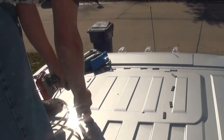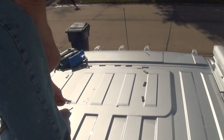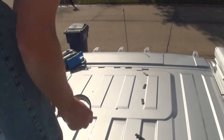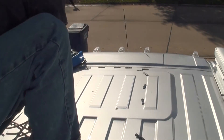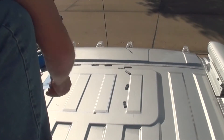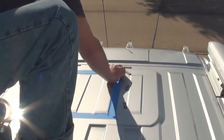The steps are easy but cutting a hole in your roof can be intimidating. Before you begin, watch the weather. First, locate where you plan to mount the fan and use the mounting flange to draw your cut line. Second, move the flange and drill a pilot hole with a drill bit meant for metal, with the diameter big enough to allow your jigsaw bit to fit inside the hole. Next, mask off the metal on the outside perimeter to prevent scratching the paint.